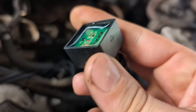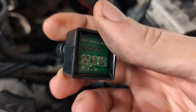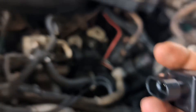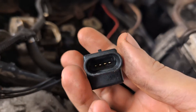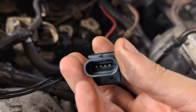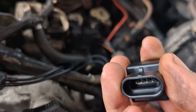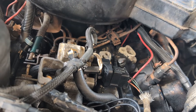As such, you can do some googling, and what you eventually find out is that part has been replaced with this part, which is a 1821712C1. And you see it has that same International logo. It looks a bit different — it's got this kind of clear acrylic going over the circuit board, the relay. But this is the new part. Reinstallation and removal are really simple — just plug it back in. I'm not going to do that right this second, because when I pulled this off, the connector got contaminated. I'm going to hit it with some contact cleaner, get all that off, then reconnect it. And then I'm going to zip tie it to something so it can't wander off and touch something hot and turn to goo.